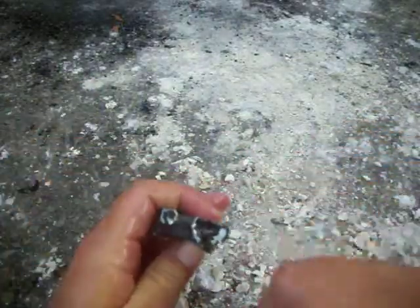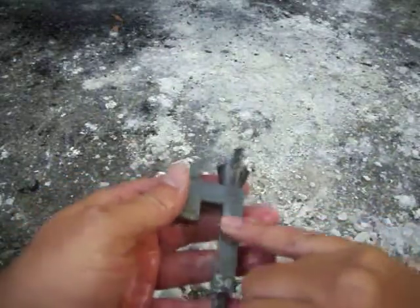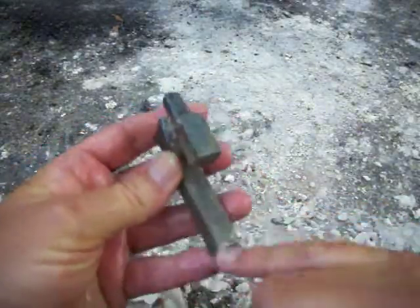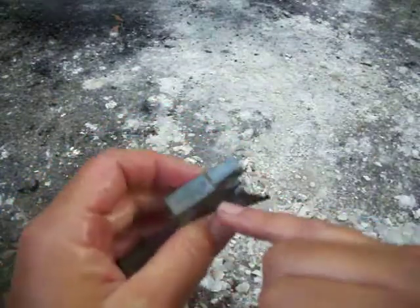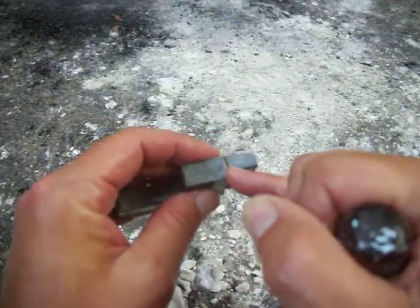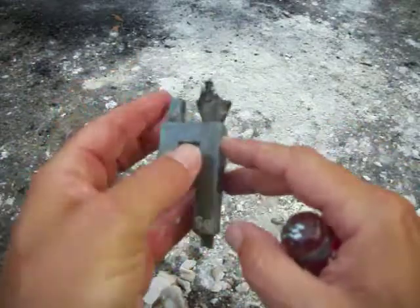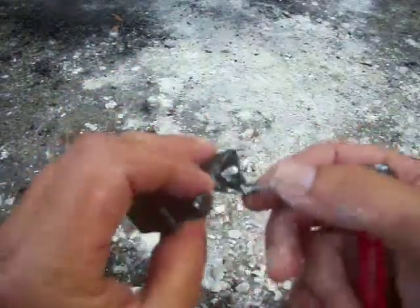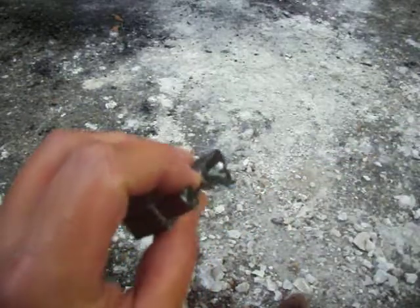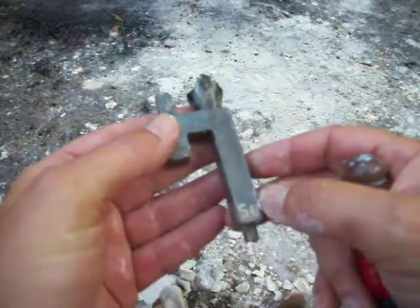Completely solid. And I just heated this over with that propane torch. Notice the top has this very glass-like finish. I don't know if I'll be able to finish the surface to make it look like that. I could try to heat it quickly, but that might just burn it. I don't want to risk it. My bigger concern is on the metal ones, I've been just taking a hacksaw to cut off the sprues. That might be a little rough for this because this is just going to break brittle. It's kind of like a fine candy, so I don't want to take a hacksaw to it.